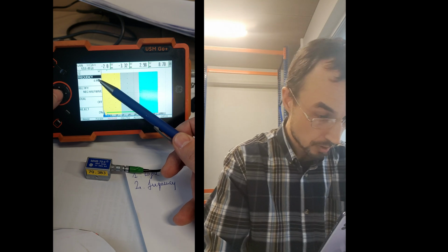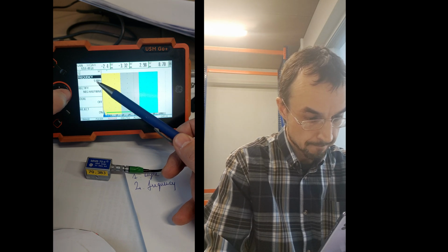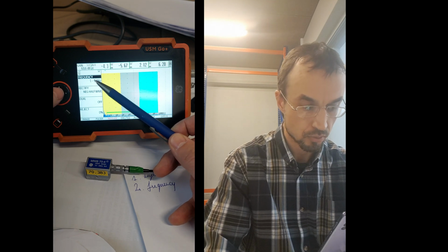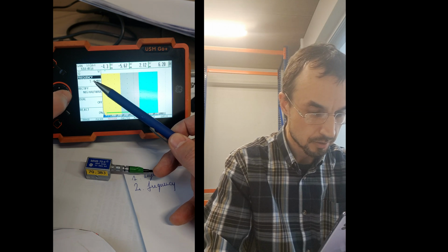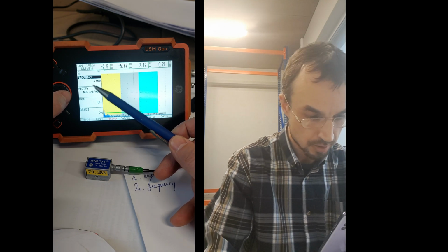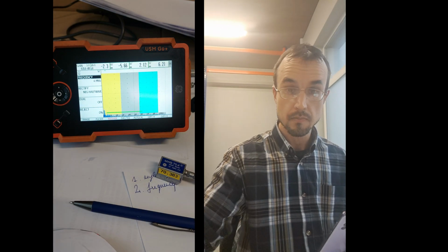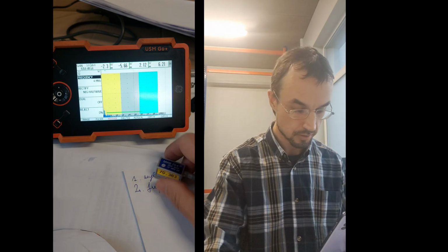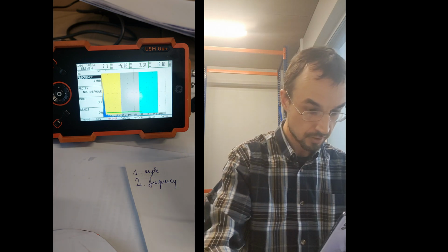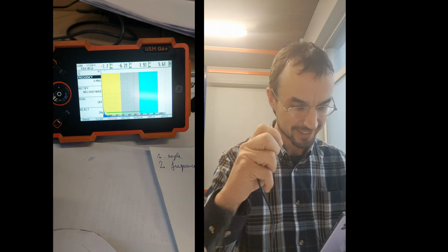That's good enough, but another setting that we can use is like this, but it's listening to more, from 1 to 5, and this is listening to 4 and around 4 megahertz. So let's put it 4 megahertz. Maybe we should also check if it's working. You just take the probe and push it with the finger, and you see that the graph, the spikes, changes, so it has a normal connection. Okay.